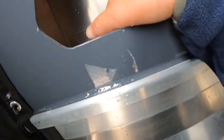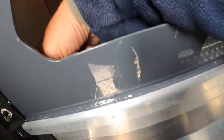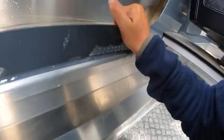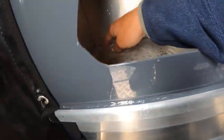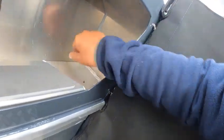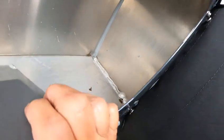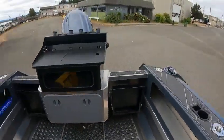There's something to think about though — they got water back here. I'm not sure if they got a weep hole. I know they siliconed it, but you need to figure a way for this to drain. They do have a weep hole right there, I think. But they may need to drill some type of hole right through here so that it will drain. If not, you're going to have standing water. Maybe peel some of this back — you don't want water from there going in there. Probably drill a little weep hole right off to the side so this water can get out.